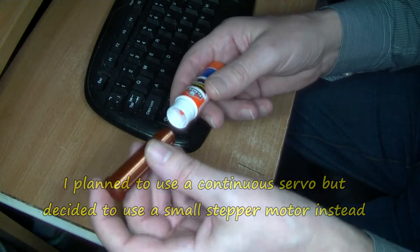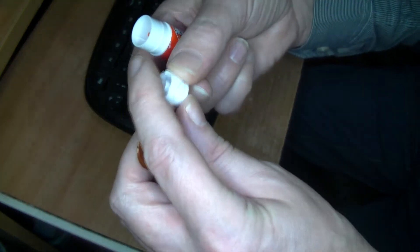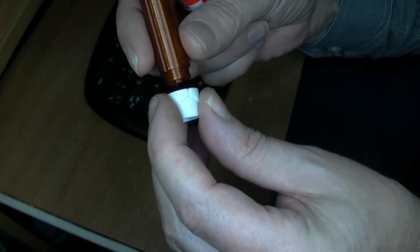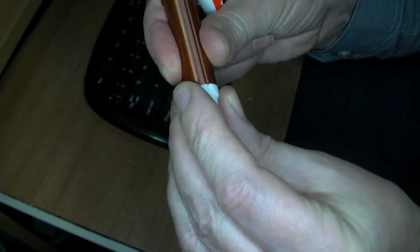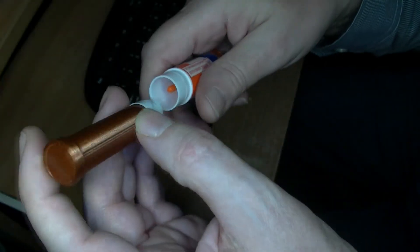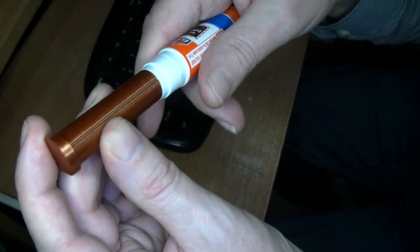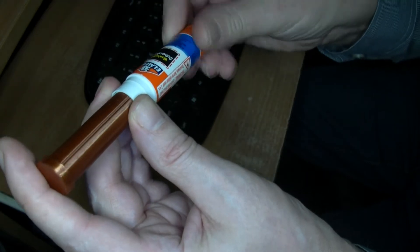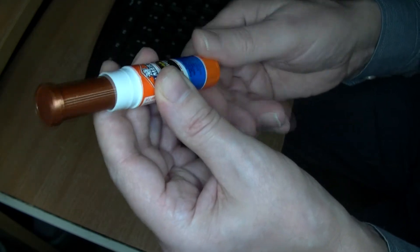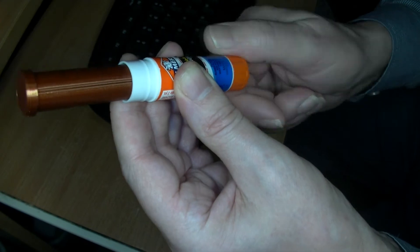After a bit of experimentation I found this was quite stiff to put in sometimes. What I found is the easiest way is: this has chamfers on there and also notches in the edge. You line up the notches with the notches on the edge, and because of the chamfers you can almost feel it — it bumps out a bit then bumps back in. When it bumps back in you know it's lining up. Then it moves quite easily. There's about 50 millimeters of travel there.